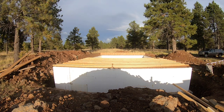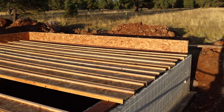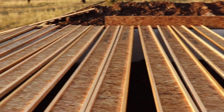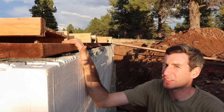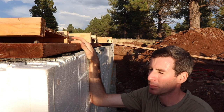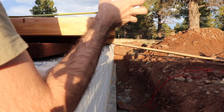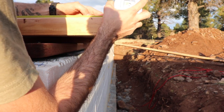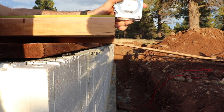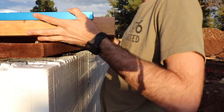I was going to wait for Chelsea to help put all the I-joists into place, because it was a pain bringing them over and then getting inside the foundation to pull them to span the full width. But she was taking a while, so I just did it while waiting and got them all done. I have to subtract two and five-eighths from every I-joist because the rim boards are two and five-eighths inches each. So 20 minus two is 19 feet 10 inches, minus five-eighths is 19 feet nine and three-eighths inches. I put a line at 19 feet nine and three-eighths and then put a square line.